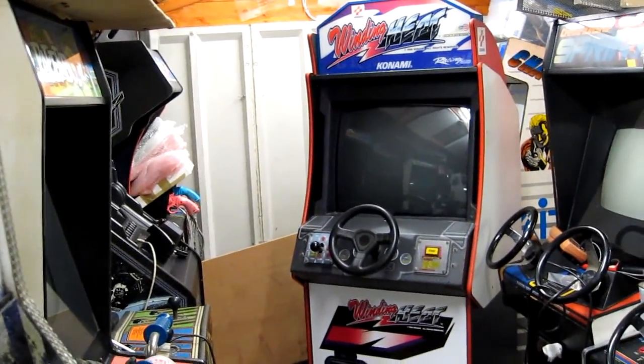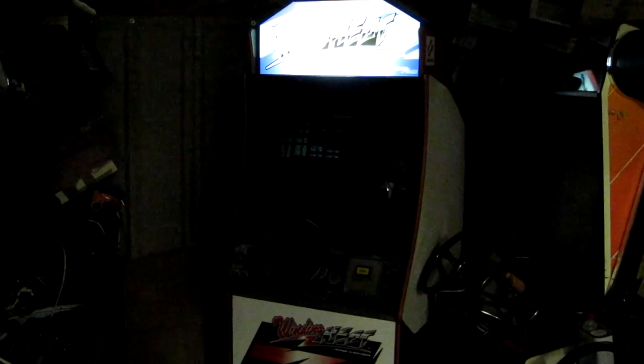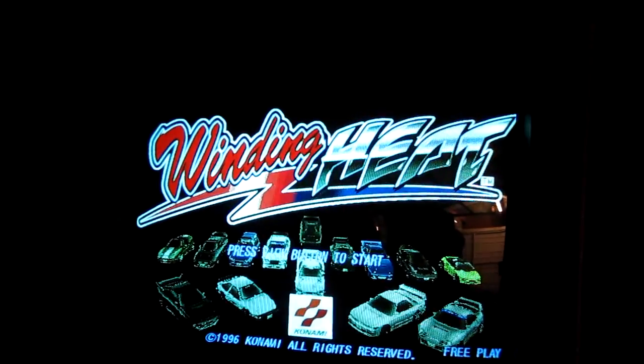Right. The monitor chassis has now been reinstalled, so let's just turn off the lights on that end and we'll switch it on. Oh, yeah, there we go, picture. Well, that's massively better. As you can see, no more border at all at the top or the bottom. The edges look a lot straighter. The regulation looks better. There's less shifting between colours.